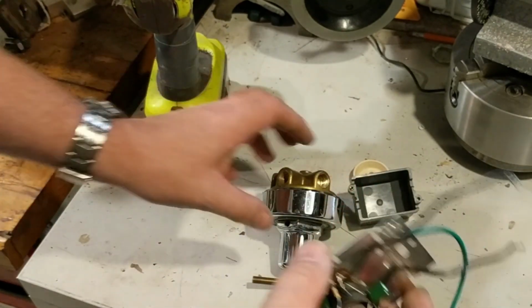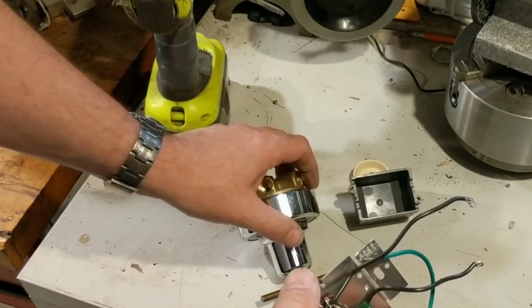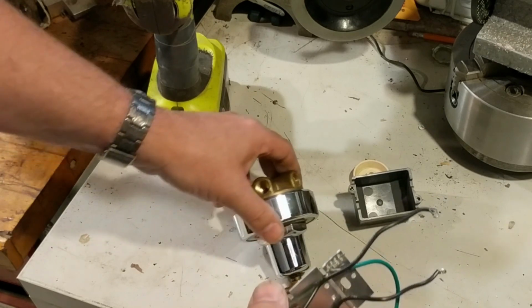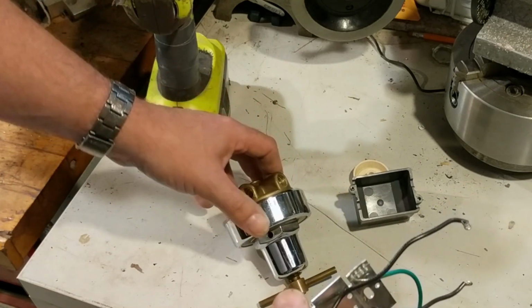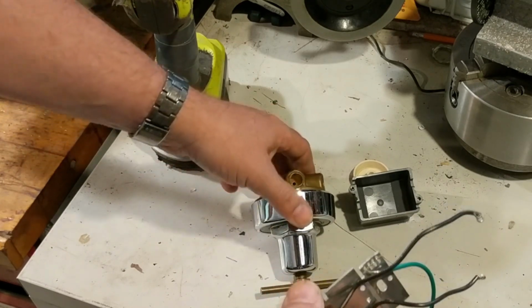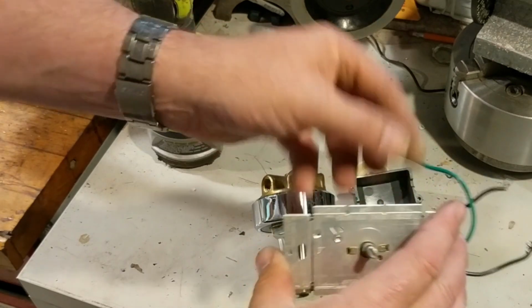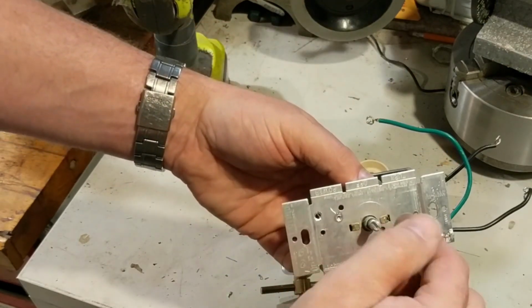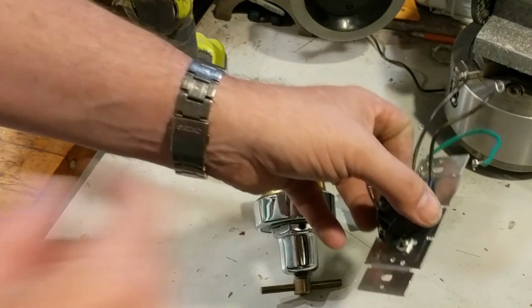So I'm not going to cram it in here in any way that's going to risk insulation breaking down later and the thing becoming a fire hazard. I want my great grandkids to see it. I don't want it to fry them, you know? So what I'm going to be doing next is getting this aluminum piece removed from the equation, getting the variable resistor out of it, and getting the transistor detached.